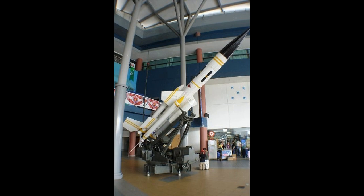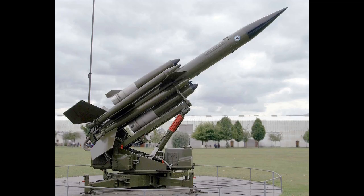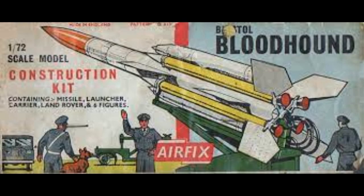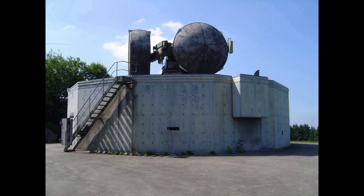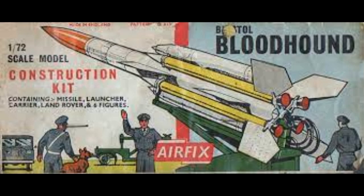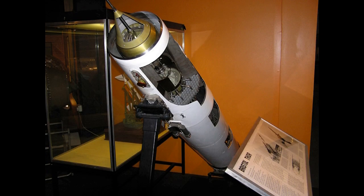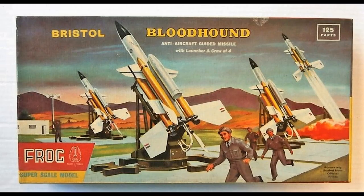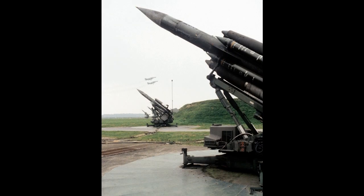The main missile is a long cylinder of magnesium frames and aluminium alloy skin with a prominent ogive nose cone at the front and some boat-tailing at the rear. Small aluminium-covered wooden cropped delta wings are mounted at the midpoint, providing pitch and roll control by pivoting in unison or independently, with additional steering provided by differential fuel feed to each of the ramjets. Two smaller rectangular fixed surfaces were mounted in line with the main wings, almost at the rear of the missile.